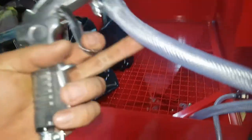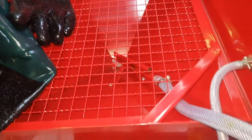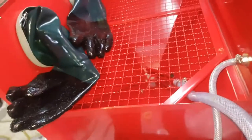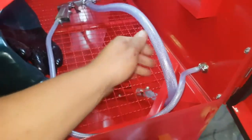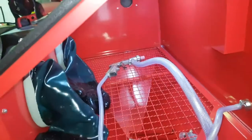Here's your actual sandblasting gun — it's just a siphon suction feed gun. The two tubes down there help you get hold of your media and that's where it actually sucks the sand up — well, sand, or some people use walnut shells, glass beads, et cetera. For assembly, when you get it, all you have to do is connect the gun to the media pickup and the airline, put a bit of thread tape on and bolt it through. This here is the air intake for when you've got your vacuum connected, which allows air to come in down this boxed-out channel section and keep a flow-through effect — keep it clean.